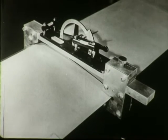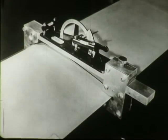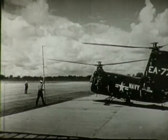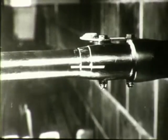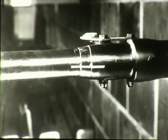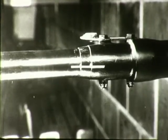This procedure is for the initial adjustment of all blades on both forward and aft rotors. Some final adjustment may be necessary after the blades have been installed and tracked. This stencil mark on the after side of the blade at the spar entrance into the split sleeve and socket is used to record the blade movement from its original setting.